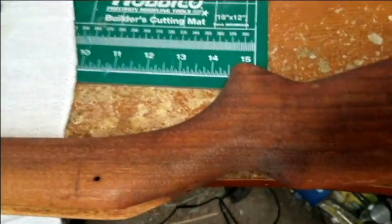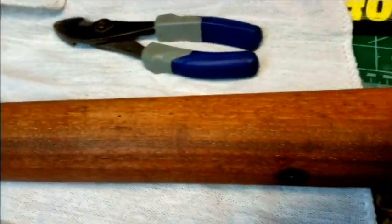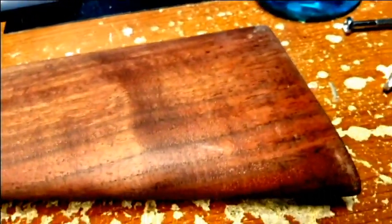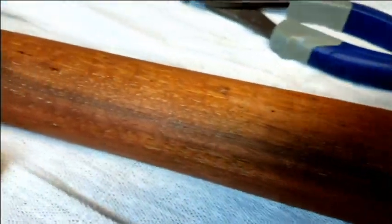Okay YouTube, I'll get my light over here, a little more light on this. Okay, stock is all cleaned off now. All the finish on it came off easy enough. For guns like this you just put some of the citrus cleaner on it, let it sit for 45 minutes — I think it was 45 minutes — and wipe it off with rags. Everything comes off. Nice bare wood, ready to be worked on.